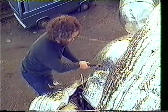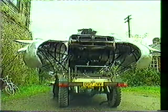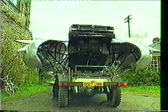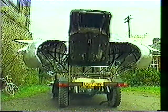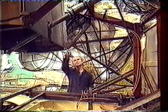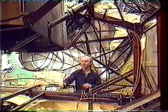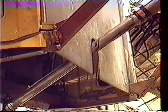The outside of the angel is being clad in beaten aluminium. As the car actually tips up, you see the underside of the car — the floor pan. And this looks a bit like a sort of tombstone with these wings out of the side, which is quite an ominous image. So the idea of making the engine compartment turn into a jukebox with lots of little fairy lights. This is the hydraulic cylinder that powers the car up — it's off an old tipper lorry, and it's a single-acting cylinder because it just has to power the car one way, and it's the weight of the car returning that brings the fluid back and closes the cylinder.